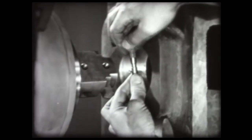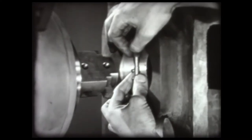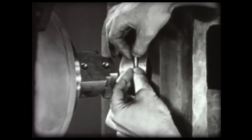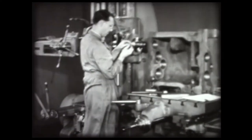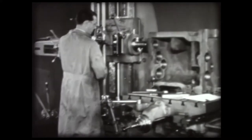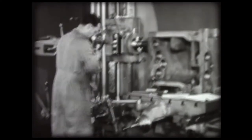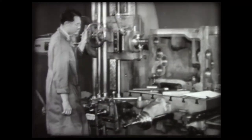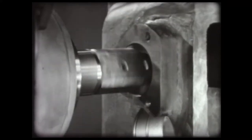An inside micrometer can be used to check the finished hole. The finished diameter is 3.6708. On this cut, about three thousandths should be left for reaming. Having checked to see that the tool is cutting to size, take the finishing cut. This hole can be finished immediately following the roughing cut because this is the last hole to be machined in this face of the workpiece.